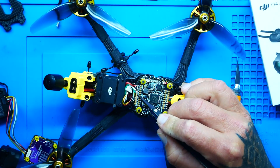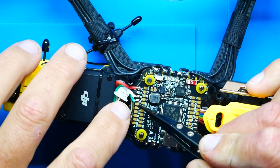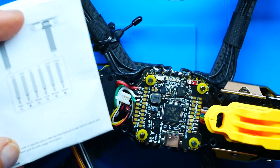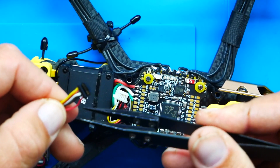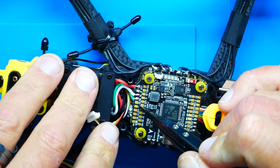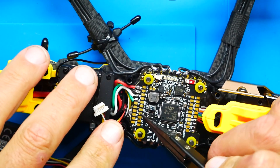On this stack I found a nine-volt pad — that'll be my power. Per the manual, that's the red VCC wire. You're going to move in order: red, ground, then white — it's literally nine-volt, ground. Then you're going to need a full UART — that means a T1 and R1, or T2 and R2, or T6 and R6. You'll need to find an open UART and that's what you'll connect to. Mine is T1 and R1.